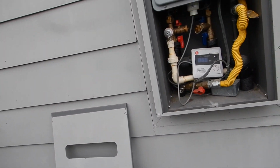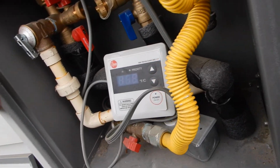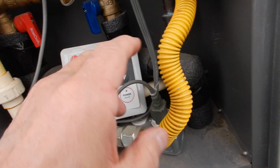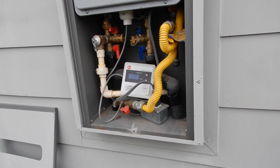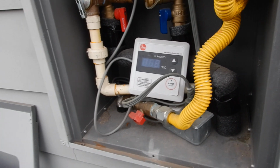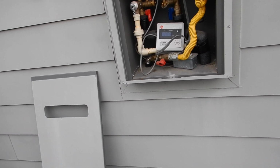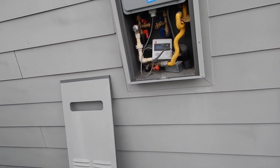Okay, now, my experience suggests, hear me out, these water lines are insulated. But on a super freezing cold day, several of my clients that have tankless water heaters on their exterior walls, even though they're insulated, have experienced freezing pipes. I'm not saying that yours are going to freeze. It's insulated. I don't know what to tell you to do about it. But brand new construction, after a big old blue norther comes in, their pipes have all frozen.